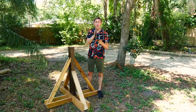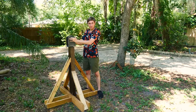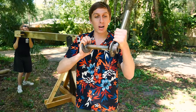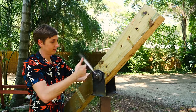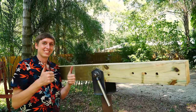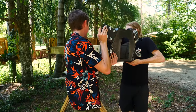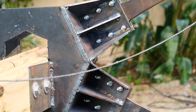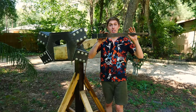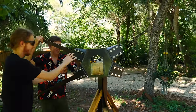We started off by building the base and the bracket to hold the giant six-inch by six-inch body of the bow. The bracket will let me aim the bow up and down and side to side, and then to secure the aim that I want, I made this giant pin so I can just crank it down and hold the bow in place. Now it's time to put the giant head on the bow. This weighs about 55 pounds and it's completely made out of quarter-inch steel plate, and this is what's going to hold the arms to the bow. These are the arms to the bow and they attach like this with these mounting plates to hold everything nice and steady.